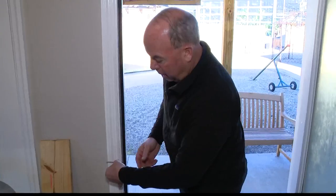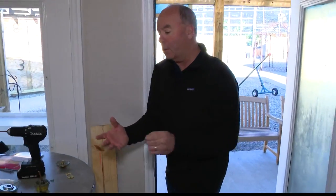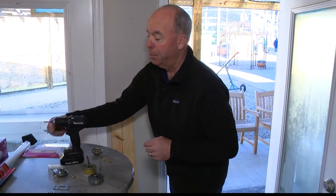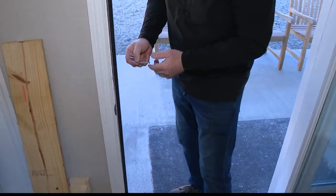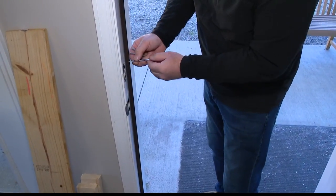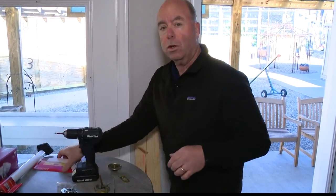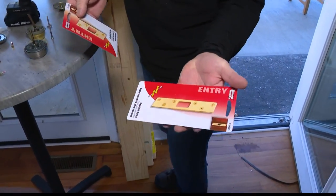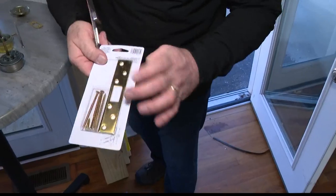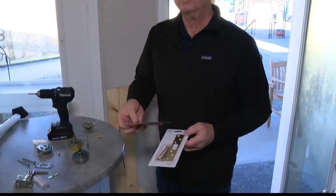So even if you have a deadbolt on your house, it's very inexpensive — go to the store, buy some screws, pull out that little screw, take a pilot bit, and all you have to do is the cost of the screw. Right there you'll really reinforce your door. You can also buy these larger strike plates. You're not buying a whole new deadbolt, but look at the size of the plate — and with those long screws, that's really what secures your door.